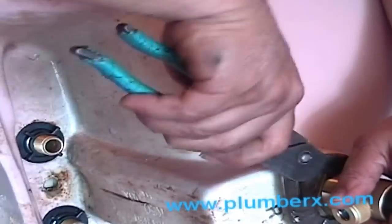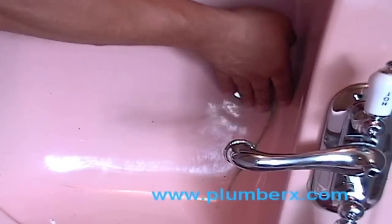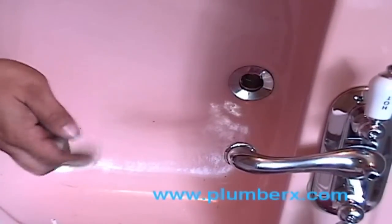Now we'll take our channel lock pliers and we're going to tighten it as tight, not exactly as tight as we could, but tight enough to get a nice tight seal, and not so tight that we will end up cracking the ceramic sink. And now here's the excess putty that's oozed out from the other side.